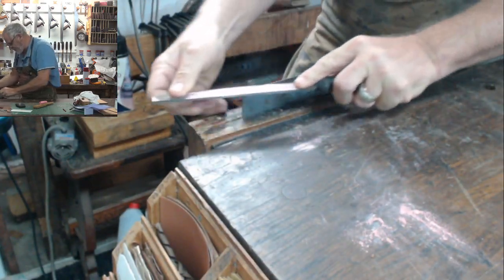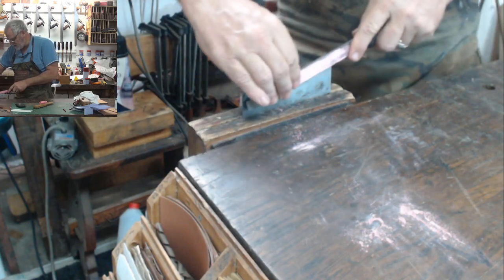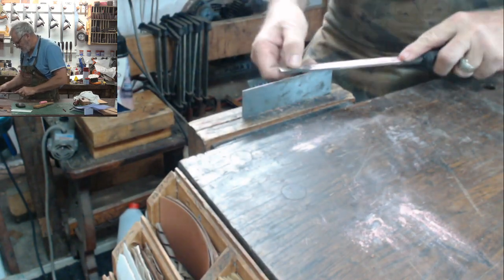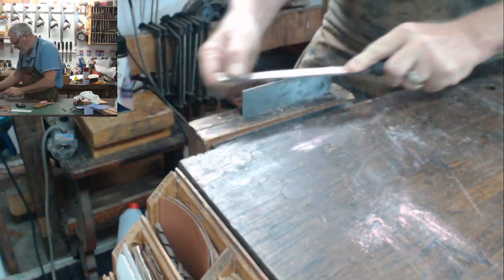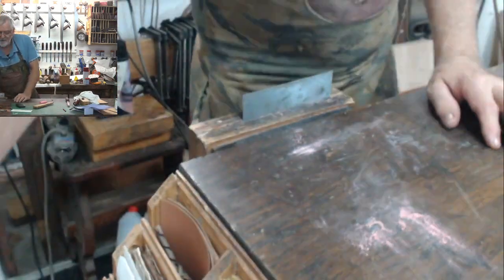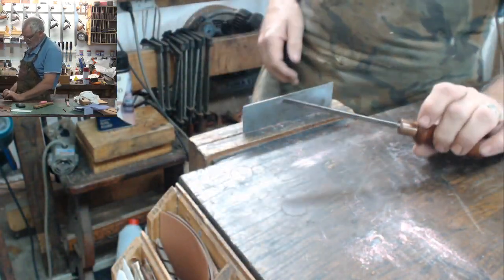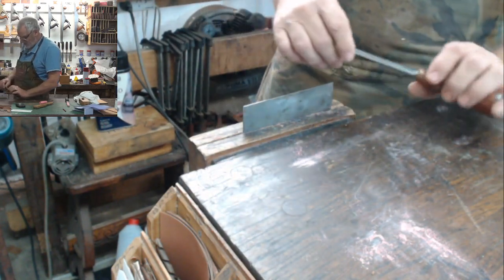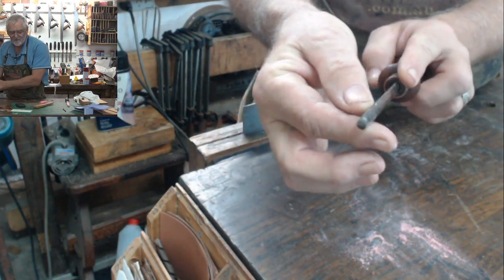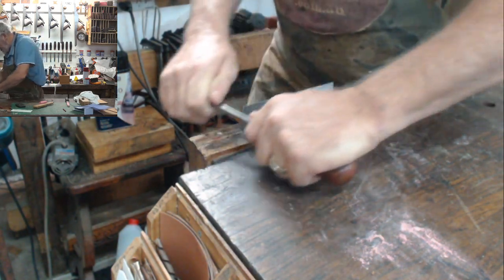Okay. So, dress the top off. And then I just cut it down there to make sure you haven't got a hook left. Get that nice and flat. Don't rub too hard because you'll cut your fingers. And then with your burnisher, you can use any bit you like. I like using the narrow bit because I'm getting more force on that. You push down and go straight across.